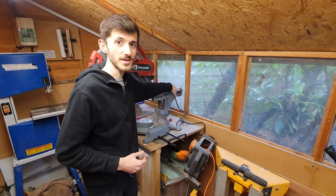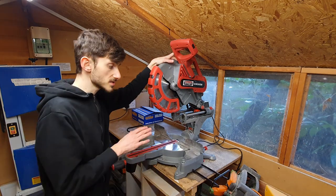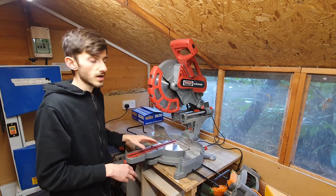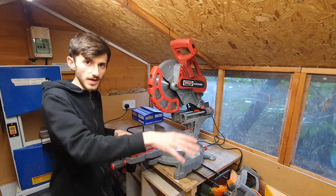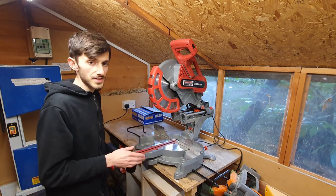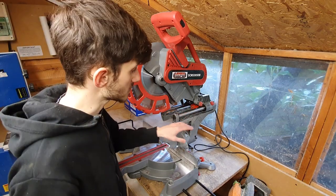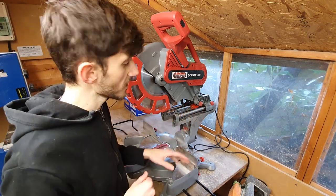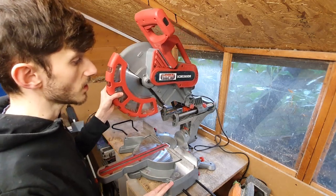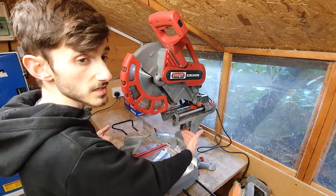The motor on the saw is a 2000 watt motor — a very large motor for a saw like this. This is the 240 volt version, but they do sell the exact same saw in a 110 volt version, which I assume is for carpenters and joiners going out to work on site. The reason I liked this mitre saw is because the slide, unlike my other mitre saw, doesn't actually poke out the back. It works by having the rails fixed in place, and the whole unit slides along them on bearings — that was really appealing to me, giving a bit shorter footprint with more cutting capacity.